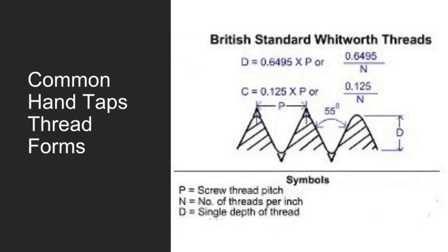British Standard Whitworth — Sir Joseph Whitworth proposed this thread in 1841; it was the first standardized thread form. The principal features of the British Standard Whitworth (BSW) thread form are that the angle between the thread flanks is 55 degrees and the thread has radii at both the roots and the crests. The relevant standard is British Standard BS 84:2007. The thread form is now largely redundant, having been replaced by unified and metric threads, but there are many applications in which it is still used.